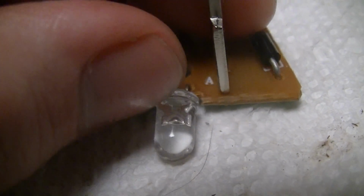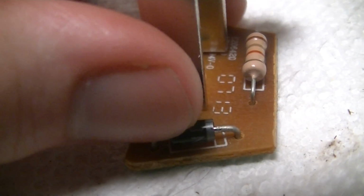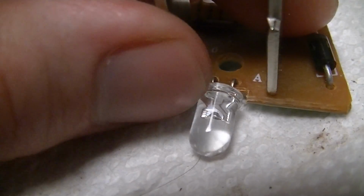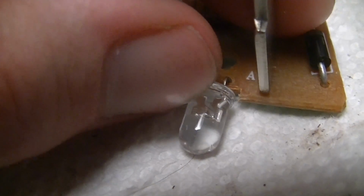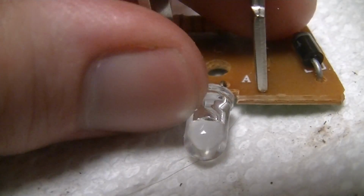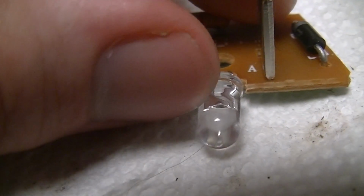much has failed short. I suspect that's due to the reverse current through the diode, which is going to be on the order of some tens to hundreds of microamperes over the years, that causes the LED to fail, because I have heard of reverse current induced or reverse bias induced failure in indium gallium nitride die chemistry LEDs, which this, being a modern blue LED, is.